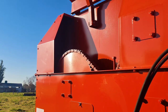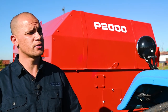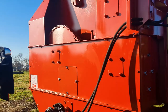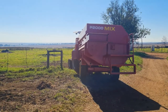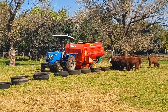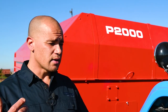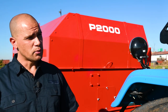In our machine we've got a 6mm floor, and on top of the 6mm floor we have a 4mm liner, so effectively we have a 10mm floor in the machine, adding to the robustness and the lifetime you can get out of it before replacement is needed. Your paddles are 20mm mild steel. Your bottom auger is an 8mm mild steel auger and your top auger is a 6mm mild steel auger. We've also got an 8-hole heavy duty rim with an 80 by 80mm axle, which is also heavy duty.